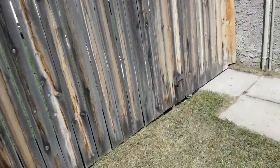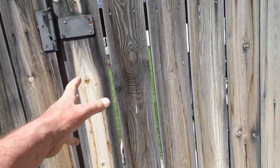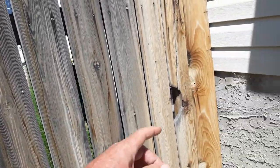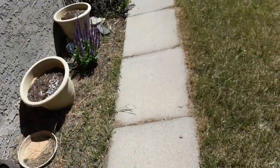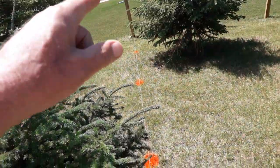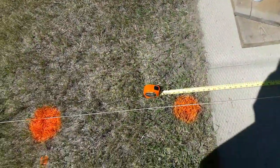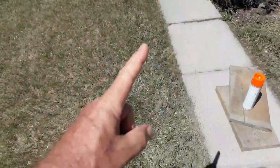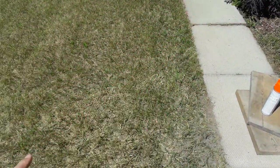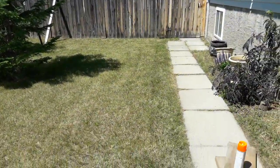Here's my old gate. I'm going to do the same thing — that's going to be approximately four feet. This gate isn't exactly four feet. These orange dots are exactly six-foot spacings — one, two, three, four — and then the gate post here. If I hang the gate on this post and I've got another post really close, I can put a diagonal piece on the backside to make that post help support this one and keep the gate from sagging. That works out great.